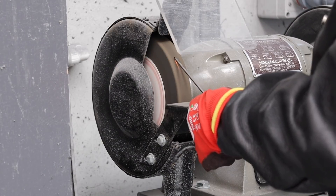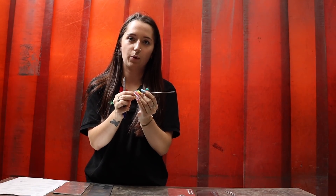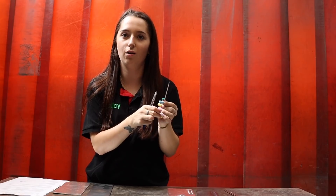If you go into the grinder sideways, you create radial marks in the tungsten — putting it in the grinder sideways — it will give you a wobbly arc and won't be as stable. But doing it at 90 degrees, like I showed you in the video, gives you a more stable arc.